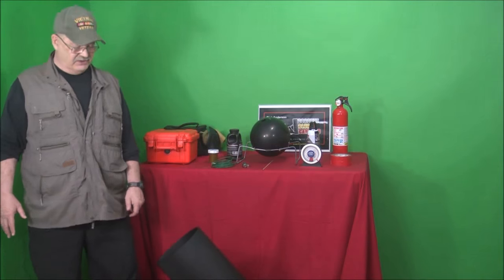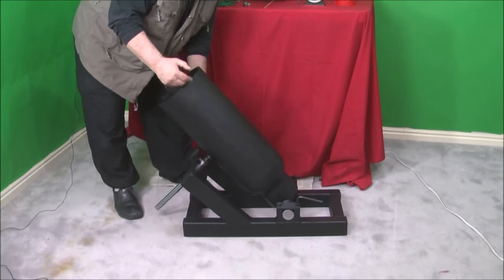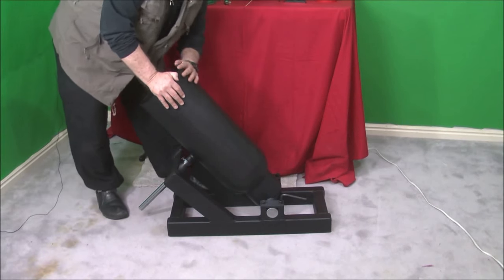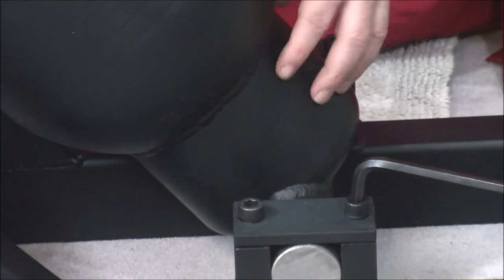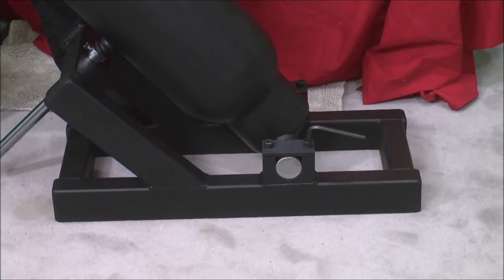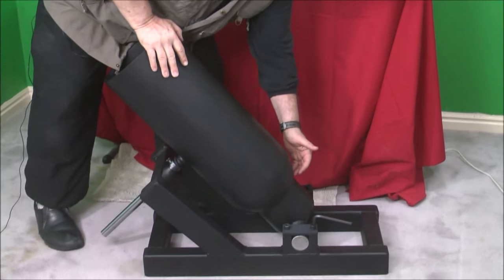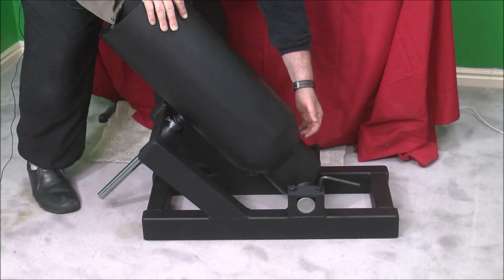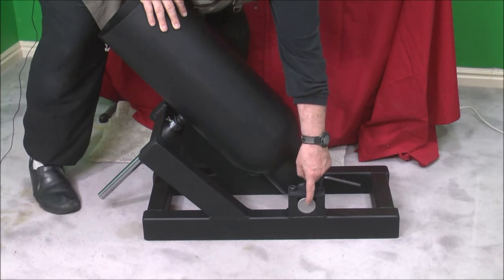In a bowling ball mortar we've got a couple of components. This is the barrel — it's actually an expansion chamber. Back here is the breech, which is where the explosion takes place and where the powder goes off. Inside is a two-by-two inch powder chamber, a hole where you put the powder in. To make you feel secure, that is a piece of four-inch by six-inch solid 1018 rod, carefully cut to be perfect, then the breech is pressed in and triple-welded by our certified welders.